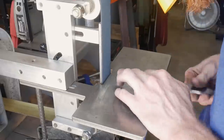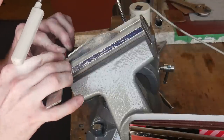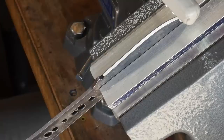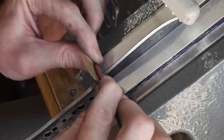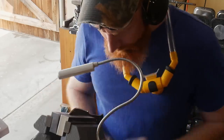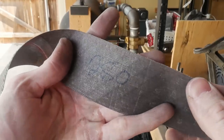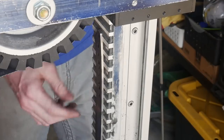I clean up the spine with a 200-grit belt, and I like cleaning up the choil area and all the spine areas of the knife to about 220 or in this case a 320-grit finish before moving on. I then put it on my surface grinder and work the finish up from a 280-grit gator belt.